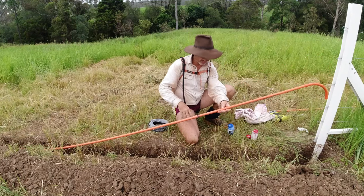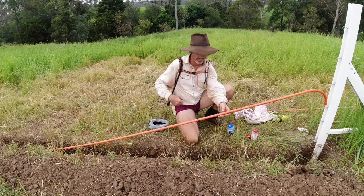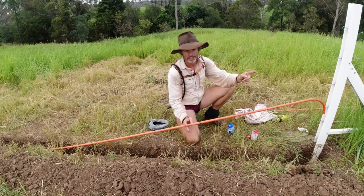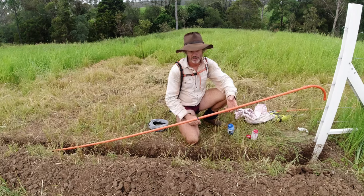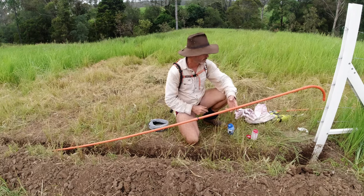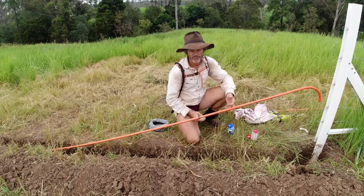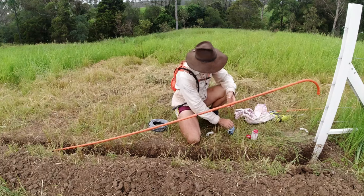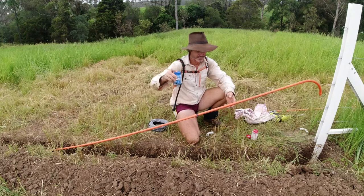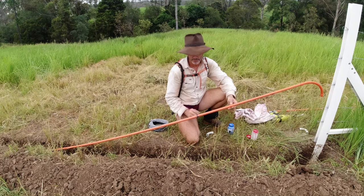The reason why I've used a fair bit of glue is because I'm going underground — I definitely don't want water sitting in this line. When going above ground, especially with this stuff, the blue glue is really visible against the orange pipe, and even worse on white PVC. When trying to do a neat tidy job — particularly at home — you can get clear glue instead, so when it seals you can't see it. It makes a real neat and tidy job.